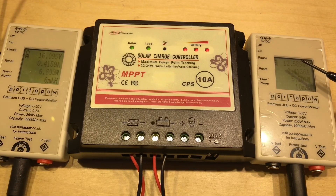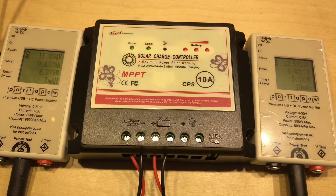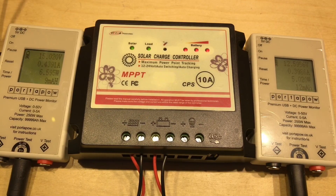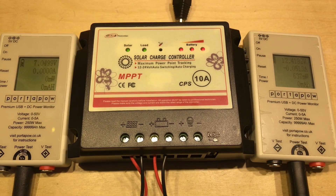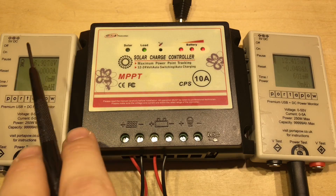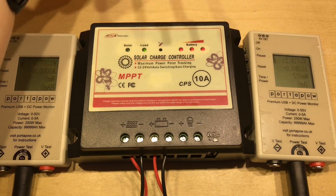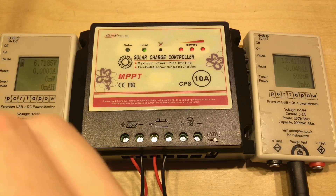The battery voltage is raising up slowly to 12.59 volts, but 15 volts now on the input. Not so much maximum power point tracking — this is almost PWM: 15 volts on the input, 12.6 volts on the output. That's pretty poor. I'm wondering if the CPS2410 is struggling with such low power coming in, but it should never really let the panels drop down to that level. The battery is still at 12.4 volts, so I've now swapped to two 100 watt monocrystalline panels in series.